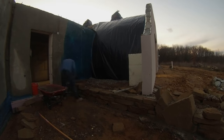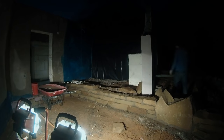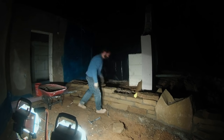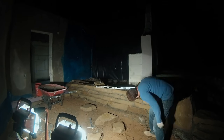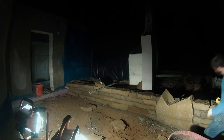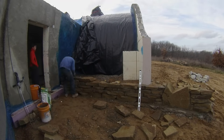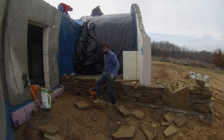These first few rows were pretty easy because it was easy to find nice flat rocks — I just used a level and laid them out. But now the hunt for the perfect rock was starting to get more difficult. I got out my chisel to improve some nearly perfect ones. The whole thing started to become more of a puzzle, except with 50 to 100 pound puzzle pieces. I mostly sorted by thickness first, and then I would bring them to the wall and try to puzzle-fit after that.